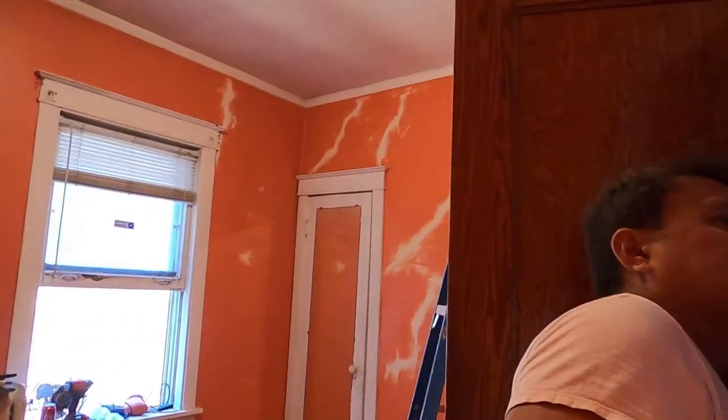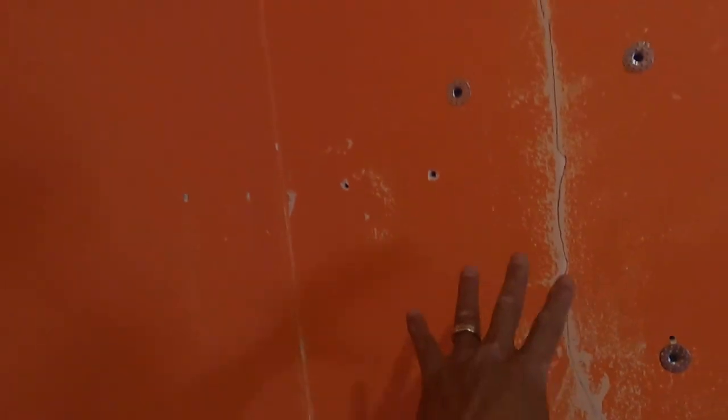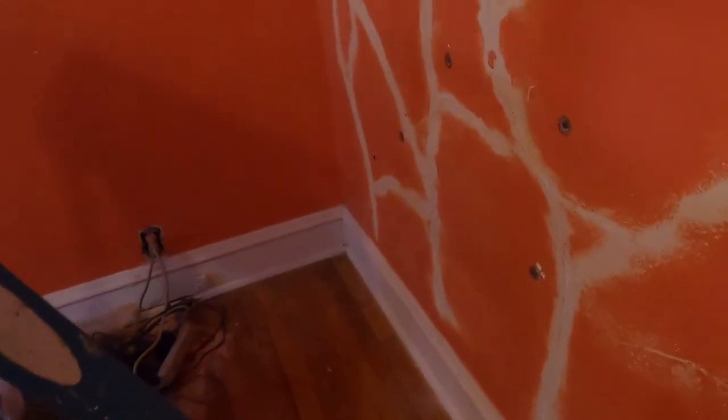Charles Street Supply is still in business. My wife just ordered — it was around $35 for 21 dozen plaster washers. That's what's holding all that in place. All the broken plaster that's sticking up, you're able to screw it down with these washers.